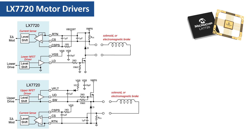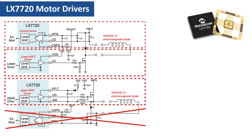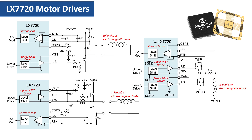The alternative configuration shown here is a high-side driver with low-side current sensing. The current sense could instead be performed by a spare ADC input if available in the system. In that case, two load drivers can be built with just one spare LX7720 half-bridge section, reserving the LX7720's current sense block for the low-side driver. These two drivers have two disadvantages: firstly, two wires are required to connect the load; secondly, the diode D is relatively lossy. Both these limitations go away by simply using the complete spare half-bridge to drive the load, with current sensing positioned in the output.